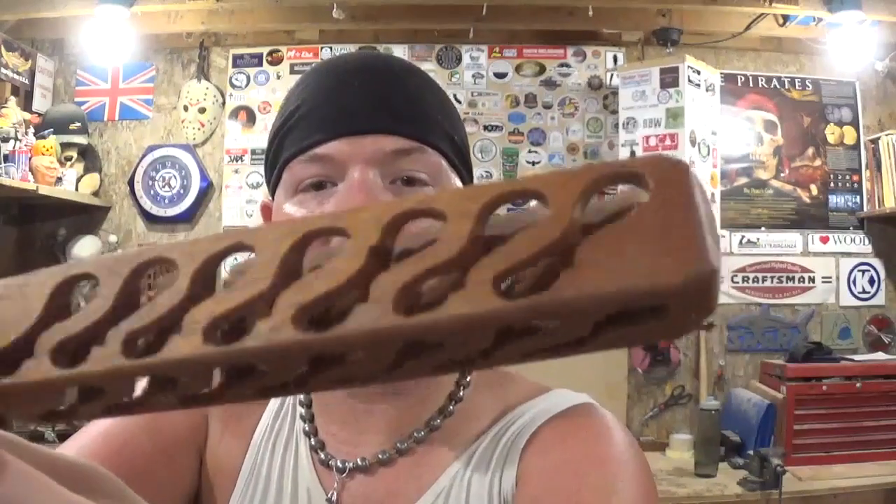If you are a cosplayer and you play a witch or a wizard, this would be something you could comfortably hold in your hand all day — it won't get cumbersome to hold or have around. Very lightweight. It took me around 25 minutes to cut this out from start to finish on the scroll saw. The mahogany wood cut extremely well — I didn't break a blade, I just took my time with it. You saw the burn mark on the stem when I cut out the first side; I took care of that over on sanding. You can sand and shape these any way you want, going farther with the sanding process and higher with the grits. I lightly sanded it with 220 grit off camera, and all in all it turned out really good.